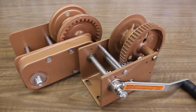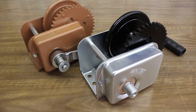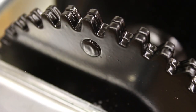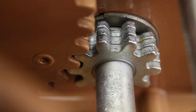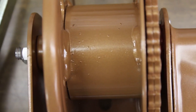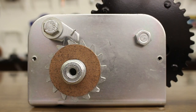So with all of these similarities, why do B-Series winches cost more? B-1200 winches are a step up from DLB winches in that they have larger gear teeth for increased strength, multiple drum hub diameter options for increased lifting and pulling speed, and braking mechanisms protected by an external cover.